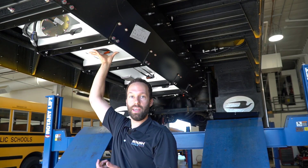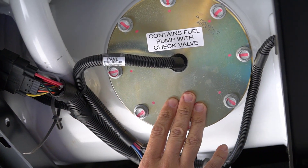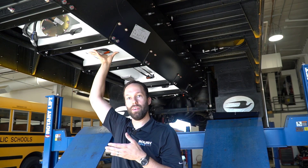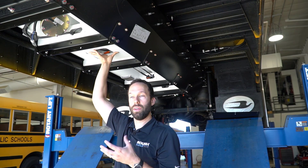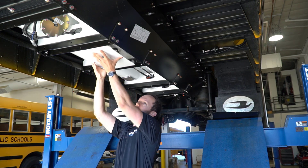Once the fuel is inside the tank, it's picked up by the fuel pumps sitting in the back left corner of the fuel tank. These sit inside a baffled area that keeps liquid by the pumps. These dual fuel pumps will pump up and through a supply valve that's underneath this protective panel.